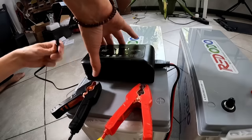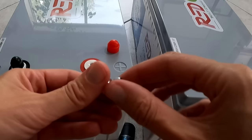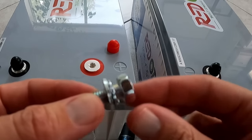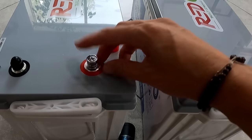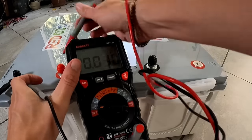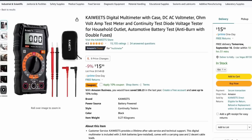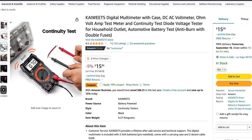So how do you charge them before you have everything connected? You need a battery charger that plugs into the wall. This is also a great backup power source — if it's been raining for a week or two, you can charge the batteries at a campsite or any other place you can plug in. The batteries come with bolts and washers; you want to fully screw them in, because if they're loose that can cause overheating. Once they're done charging, you can measure the batteries to see if they're at the same voltage. It's not required, but it's not a bad idea to have a voltmeter. You can also measure your solar panels with it, just in case anything stops working — it's a great diagnostic tool.